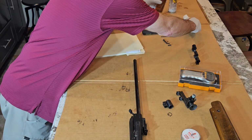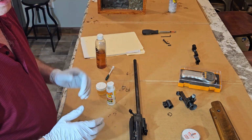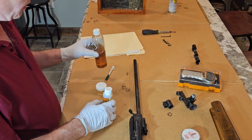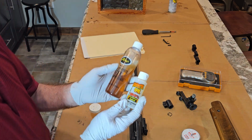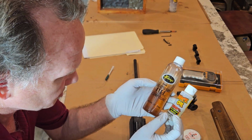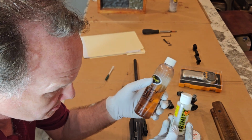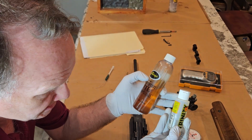Cup seals that are leather should be really lubricated with something that keeps the leather supple and doesn't combust or cause dieseling. One way to lubricate the seals, and I kind of prefer it, is a mixture of neat's foot oil and pure 100% silicone shock oil. It's pure silicone. It doesn't evaporate very easily. It's like an oily substance, but it's pure silicone.